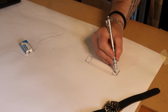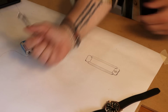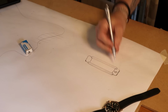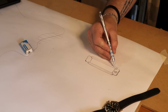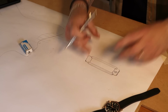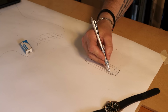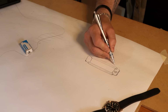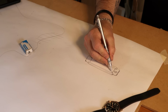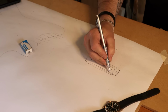Essentially, I'm not going to need very much in the way of comfort carves. We've got a couple of bevels on here, and it's going to be very comfortable on your arm. It should be strong enough, even with the cross grain. All we have to worry about is how we are going to affix these things and make them all work. The option that I have chosen is to actually use bolts going through from the front to the back entirely. But what that actually means is that I'll need to make that a little bit more substantial.